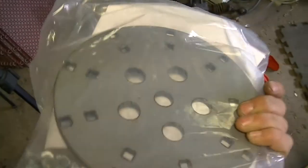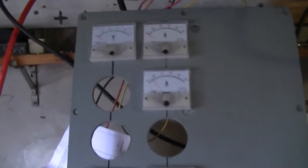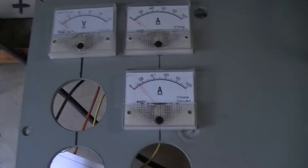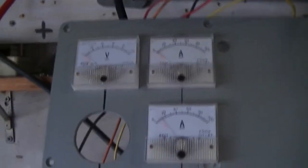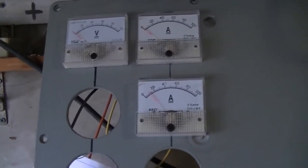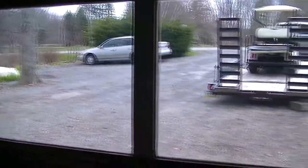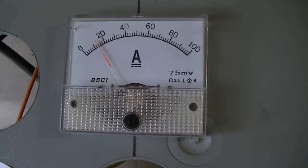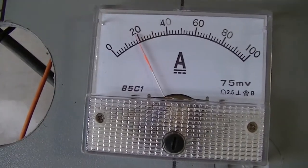The main focus today was these things coming from Thermadyne — the blades and the hub. I just wanted to explain what my testing phases are going to include and we'll go from there. Don't expect results immediately — I want to make sure I get as much documented data as possible, and that's what the watt meters are for. I'll use them to document all the data along with the Davis weather station, which I'll mount on the wall next to all that stuff. Got a little cloudy out there — I'm making 15 amps now. Sun's coming out.